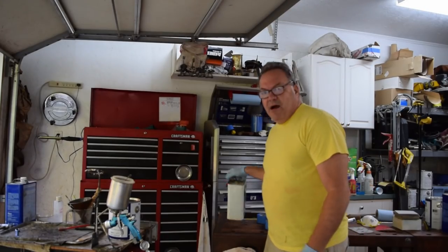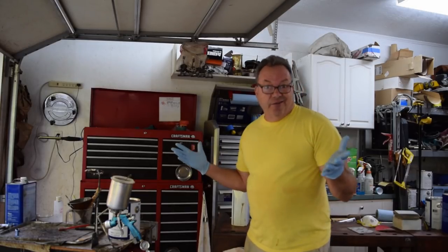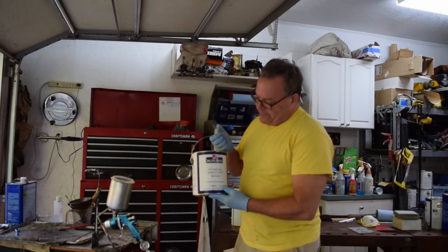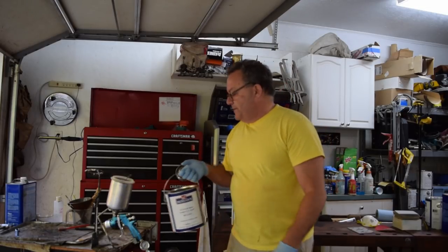Okay, we're all wiped down. I use naphtha, which is like mineral spirits, but it flashes off a lot quicker. It's a, I guess, a higher distillate or whatever. Here's what I'm going to use to seal the project with. This is Mohawk's Easy Vinyl Sealer. Mohawk is not a sponsor. I use it because it's good stuff and I can get it locally.